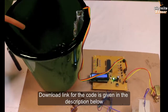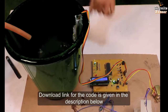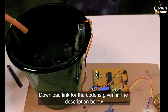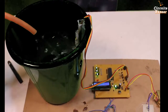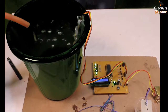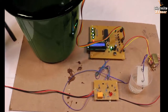After one level, the motor should turn on automatically. The water level is trying to become empty and the motor automatically starts, filling the tank until the level reaches the fullest: level one, level two, level three, level four — and after level five, the motor will automatically cut off. The LCD message shows 'Level 5' — tank is full.